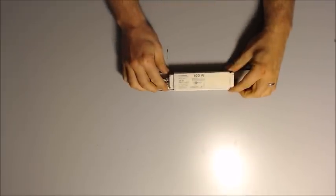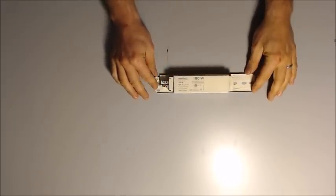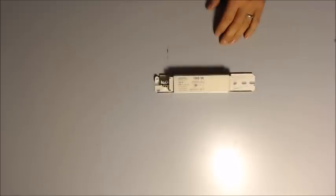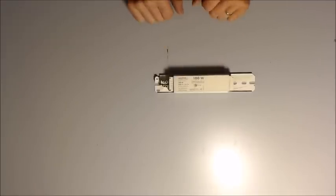All right, let's first introduce some of the components here. Here is our ballast. This guy here is an iron core with a whole bunch of wires wound around it, and that creates basically an electrical brake because of alternating current. Once it's wound into a spool like this, it acts basically like a giant resistor. That type of resistance is called an impedance. It also has another function: it's the one that creates the high voltage spike that we need in order to start a fluorescent lamp.